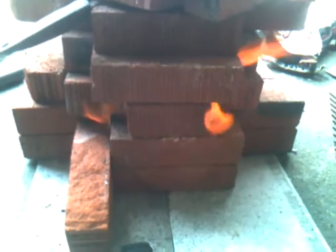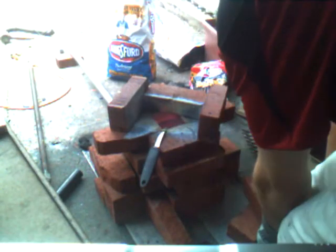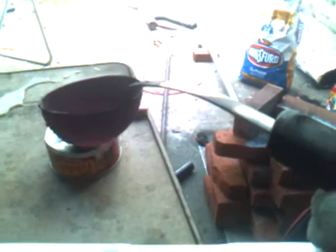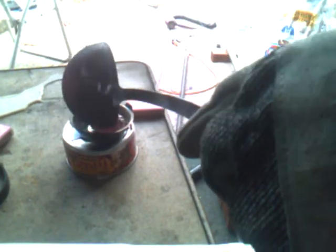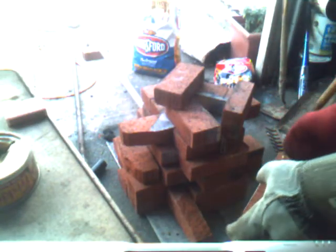Right now it's about 2800 degrees in there, judging by the fact that it melted the steel in the bottom and it's melting this aluminum in like 5 minutes. Right here I'm about to pour it — the ladle is glowing red right now. The clumpy stuff at the top that I'm trying to scrape off is just residue and the coating on the aluminum foil itself.